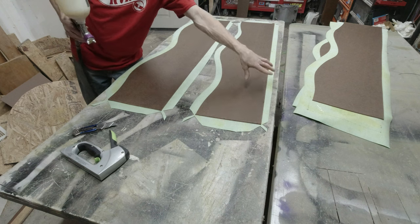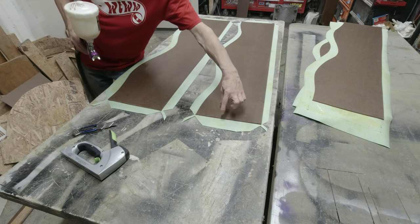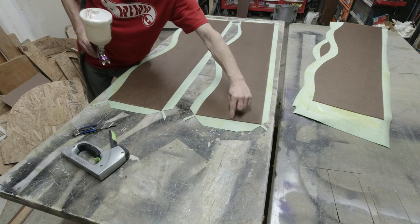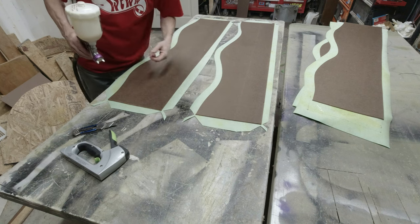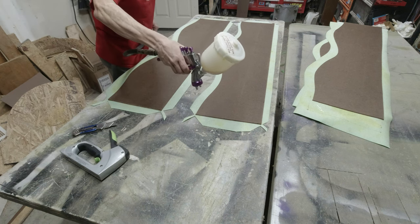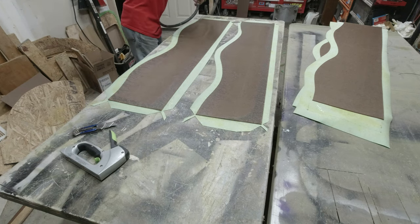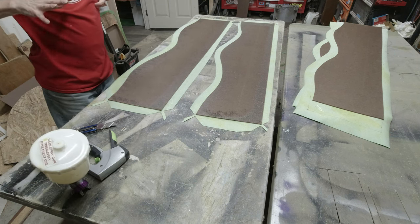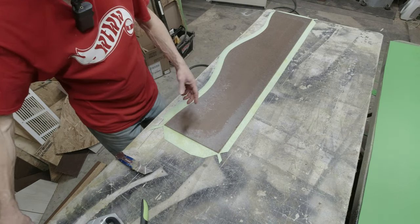Now the front sides of these are already all glued. Everything's all good to go that way. So now we're just putting glue around this, about this much of the perimeter of it, because there's no sense in gluing all this, since obviously nothing's going to be over there. So let me glue these up and I'll show you how we do those corners. Now we're going to give this just a couple minutes to set up.